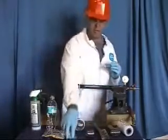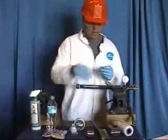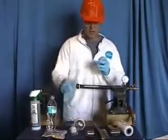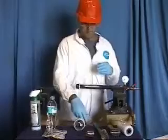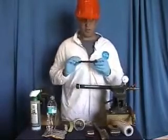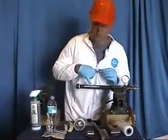At this time, we're ready to stage our materials to do the actual sealing application. So we'll need our 2-part putty, and we'll also need our pressure sealing tape. Need to remove the packaging on the putty, the outer as well as inner packaging. Once we remove the packaging, we'll stage the putty and remove the packaging on the pressure sealing tape, the outside adhesive packaging and the inside packaging. We'll stage the materials so that once we've kneaded the putty, we can apply them as quickly as possible to the repair site.